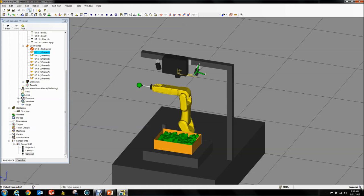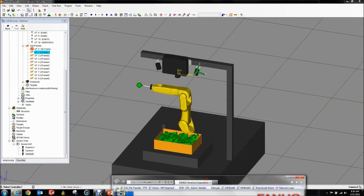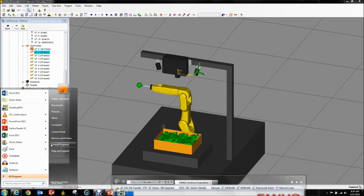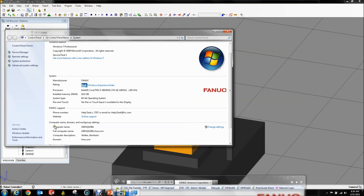What we're going to do is go to Computer, right-click, and go to Properties. Down here you'll find your computer name — you want your computer name. Mine's some weird number. You want to put that into the address bar, and we're going to go to mine — you can see I have the computer name and then my port specified as colon 9000. That'll bring up your robot homepage.